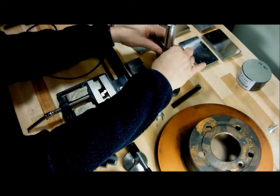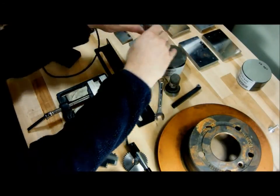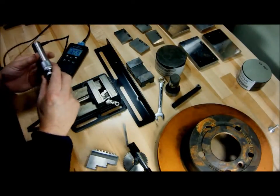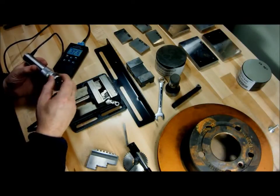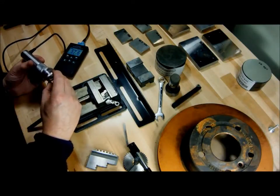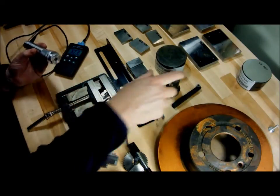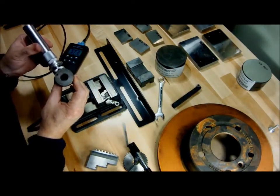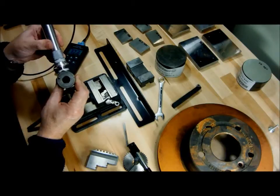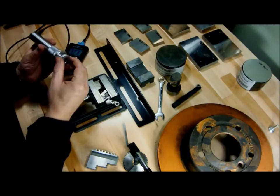This work means when they're on the part and you're doing a test, you can fit the foot on, just push down, the unit beeps and will give you a reading. We can also screw this part of the foot off, turn it over, and screw it back on. Now we can measure very, very accurately because we can hold it perpendicular — which is critical with these devices so that when the test is done it's perpendicular against the part. This shoe slides, so it moves up and down to show the test face.